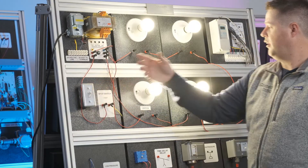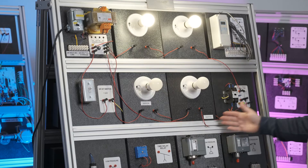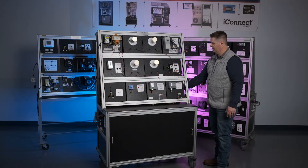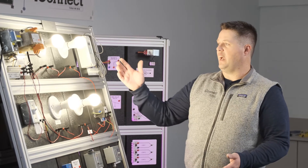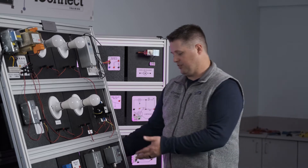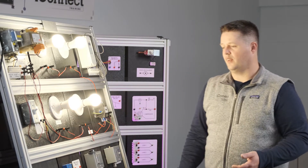As we turn this on, all four light bulbs come on right away — our switches have made. Parallel circuits have more than one path back to common, so if we unscrew one bulb, we're only opening one circuit path — the top circuit still remains. However, if we bug the high pressure switch to lose the control circuit, the contactor turns off and everything shuts off. We can set this up for students with two problems to locate: find the high pressure issue first, turn it back on, and then find the second issue — the bugged light bulb.